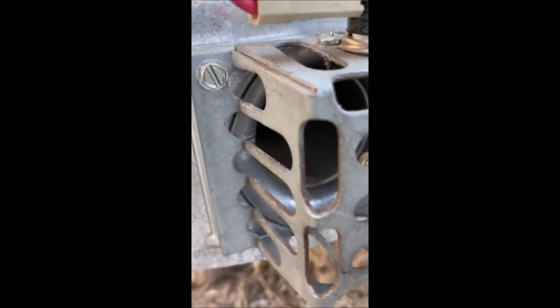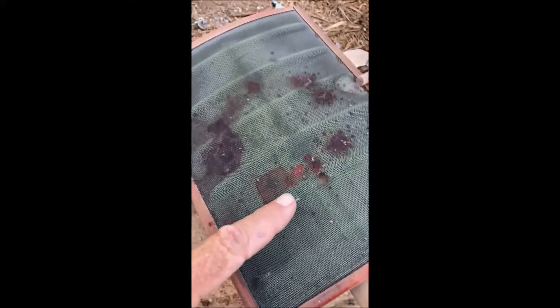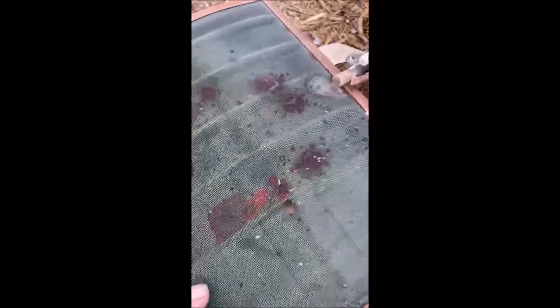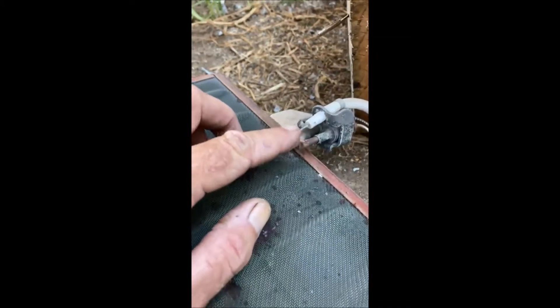All this fuel starts burning because it's sprayed in here. I'm not a big fan of these burner assemblies, but basically it takes the natural gas and sprays it down this tube. The fuel travels down this tube and enters the burner assembly here, drifts up, hovers on this mesh, and then catches the pilot light right here.